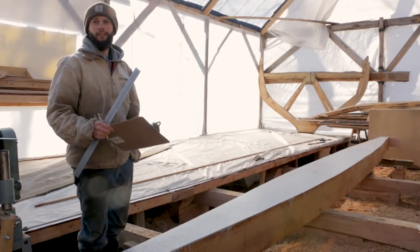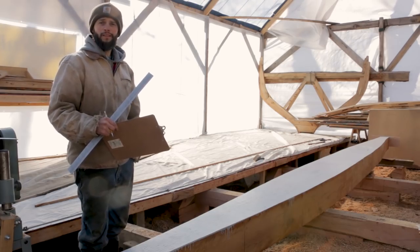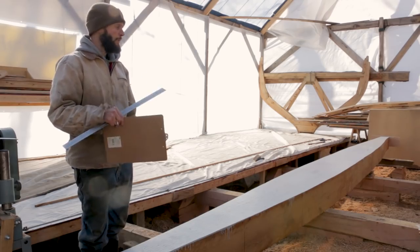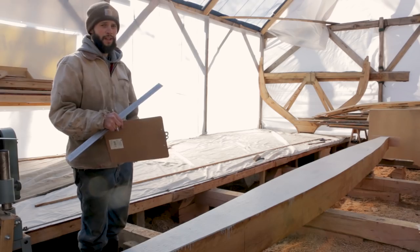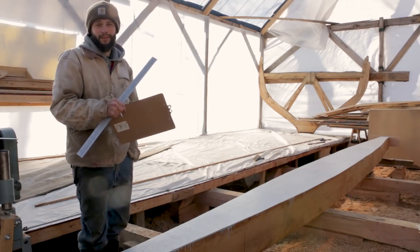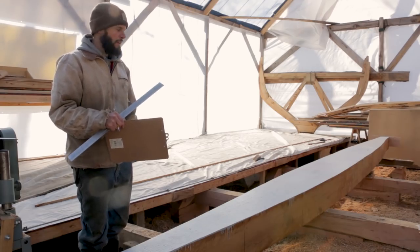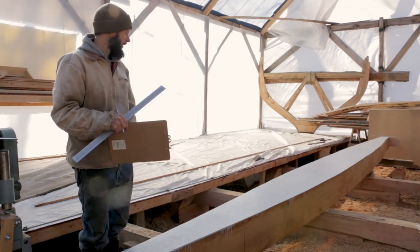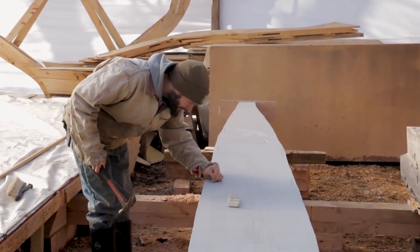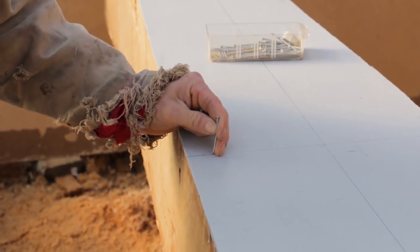According to this, we didn't cut it too narrow — so that's a good thing. This whole stage is kind of nerve-wracking, where we're making all these individual pieces that all have to come together precisely off the lofting — hand-drawn plans from 1934. Once we start fitting wood to existing wood, I'll feel a lot more confident. But so far, so good. The final step is to spring a batten through all the marked points to produce a fair curve, marking the shape of the top of the keel — done the same way as when we were springing curves for the lofting floor.